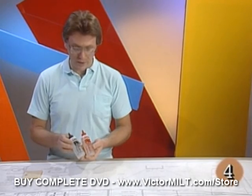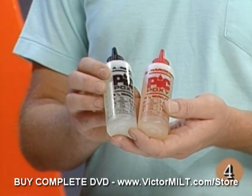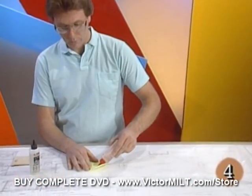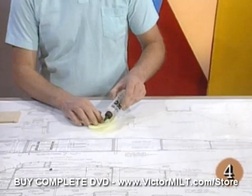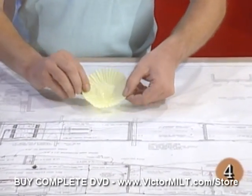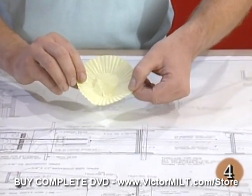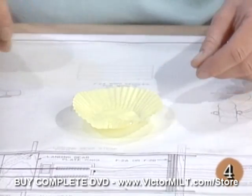We've got some four-and-a-half minute epoxy here, which gives you about four to five minutes to work with. We'll begin with a modest amount — component A and component B. You can see we have approximately equal portions, and it's very important to try and get them as near equal as possible.